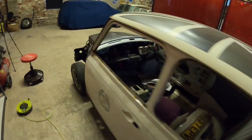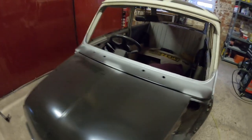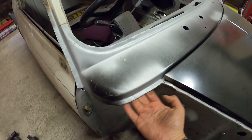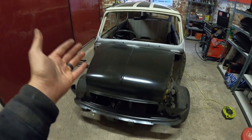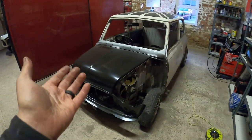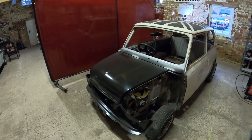While that flashes off, what I'm going to do back on the car is get the seam sealer out and just seam seal all the way inside all of these apertures, just so I know it's protected from the elements. Because at the end of the day, Little Eve needs to be back on the road and they need to last — let's give them a fighting chance.